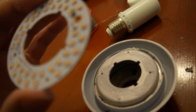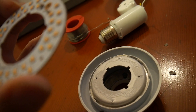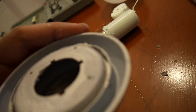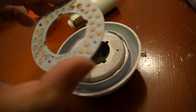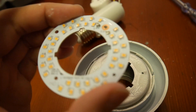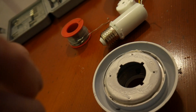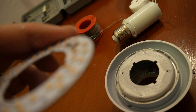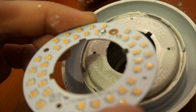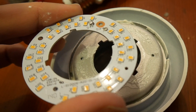Maybe this is relatively normal thermal compound, like you would put on your CPU. I could take this to Berlin and maybe use it as a studio light or something — just apply some constant current and it may still work, at least the LED part. That metal base is intended as a heatsink for the LEDs to cool them. It's an interesting PCB — a metal-backed heatsink kind of PCB — which explains why we had a hard time soldering on this. You can see the traces of the PCB there on the reflections.